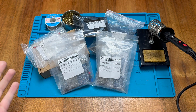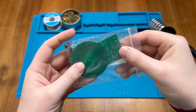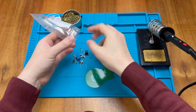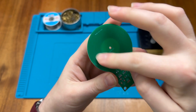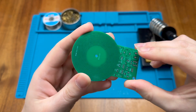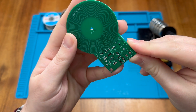First thing to do is clean up, turn the soldering iron on, and we can get started. Here is our metal detector kit — it contains a PCB but no instructions, so hopefully there'll be enough information on the PCB to assemble it. What's interesting is there's a circular track on the board which is actually part of the circuit — it's the mechanism the board uses to detect metal in the surrounding area. There's silk screen on the board so we can identify which components go where.